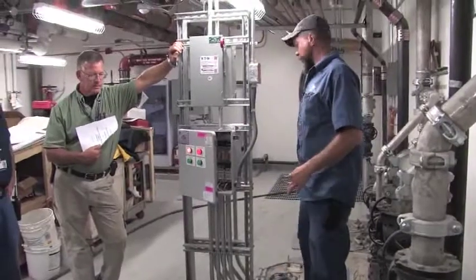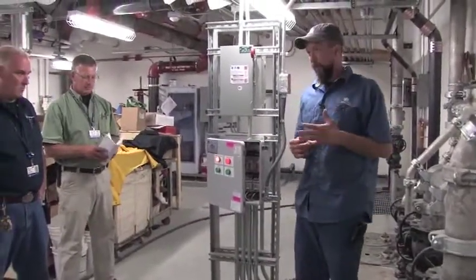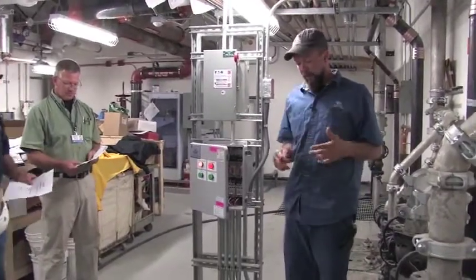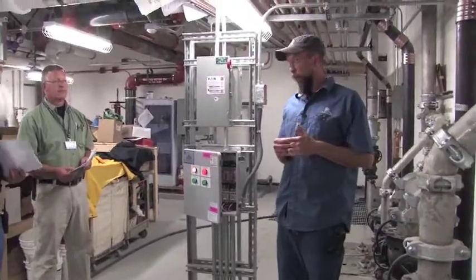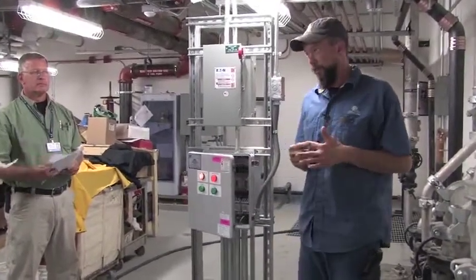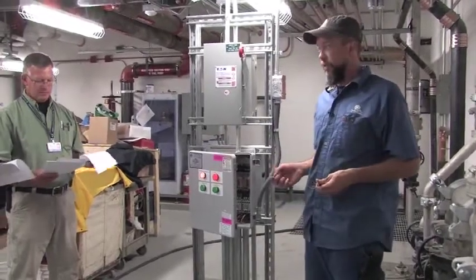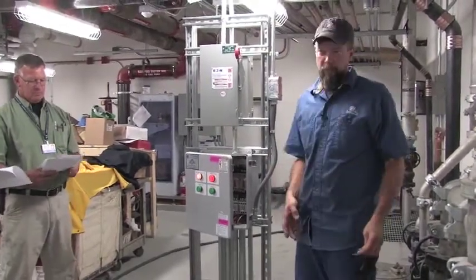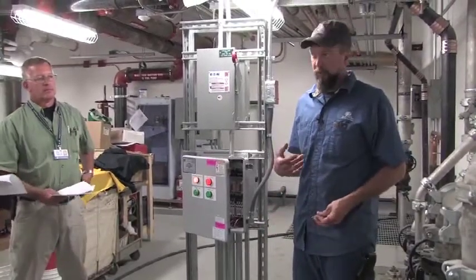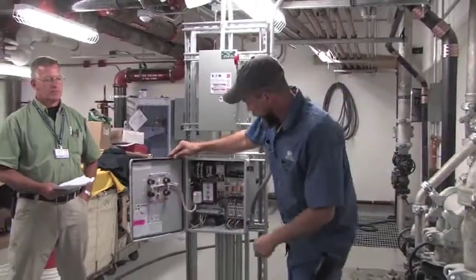I filled the pit. If you look on that second page, it shows a series of four floats. The bottom float is the ready or standby. The second float is the lead pump. The third float is your high water alarm, which is initiated right now. The fourth float — the top one — is your lag pump. They'll lead, lag, auto-alternate every time. The idea is one pump should be able to handle the duty of the pit every time, and then you get your alarm for somebody to pay attention if something's going on. It looks like you're hooked up to BMS here.